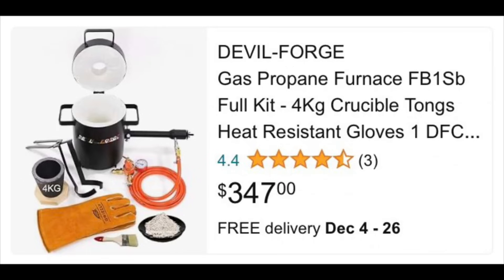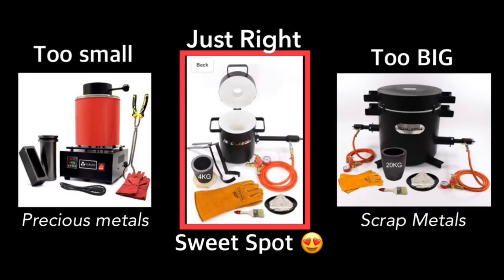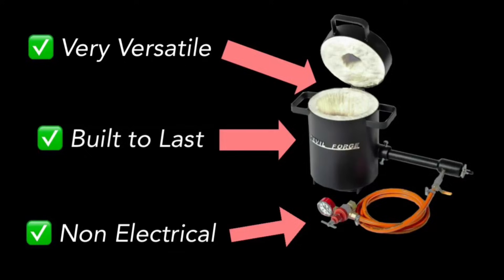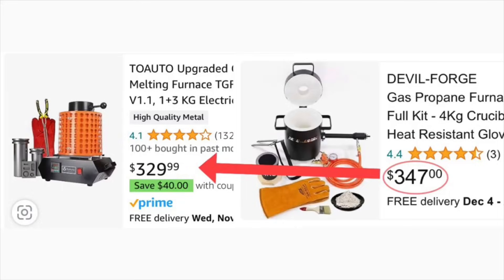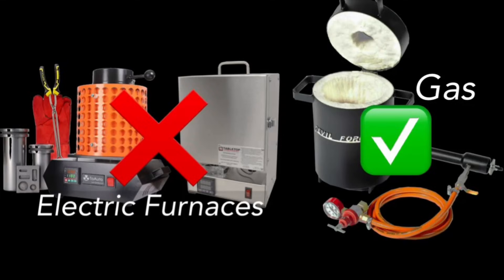Another great option is going with a gas-powered furnace — specifically a Devil Forge four kilogram gas furnace. What's great about this is it's in that sweet spot where you can't really decide if you want to do scrap metal or precious metals. It's not totally overkill for small stuff, but this machine is going to last a lot longer and can put up with a lot more abuse. We also don't have any electrical components, so you don't have to worry about a sensor or heating coil going bad. Even though Devil Forge isn't sponsoring this video, they're a pretty great and well-known company, and I see a lot of people using their forges and gas-powered furnaces, so it's a pretty safe bet.